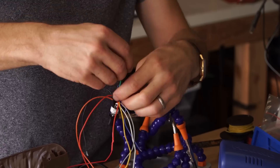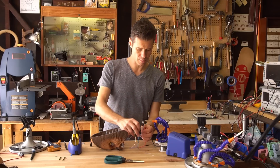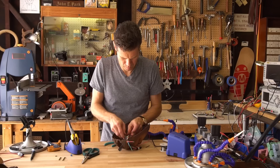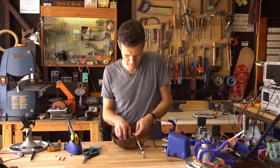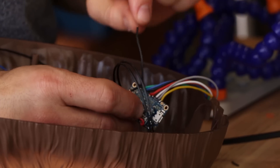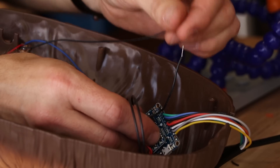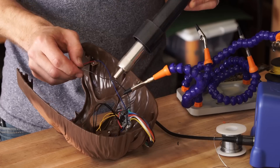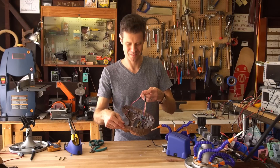If we go to the next position on the switch, those are the ones that'll be triggered, so we have a whole bunch of different sound banks. Next thing we're going to do is add some heat shrink tubing. Then we'll tin these wires and solder them onto the audio effects board to their corresponding pins. Those are soldered. There is one last connection to make — you'll remember this little ground lead that we soldered to the audio effects board at the beginning. That is what's going to get connected to the momentary switch on the mask and will create the circuit when we open the jaw.